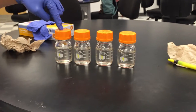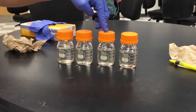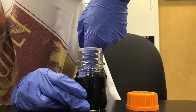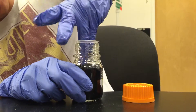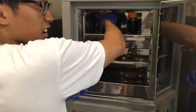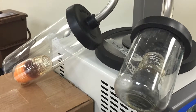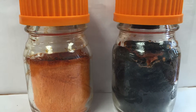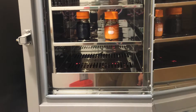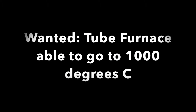We had 4 samples: Sample 1 was an ambient-dried carbon aerogel; Sample 2 was an ambient-dried carbon fiber-reinforced aerogel; Sample 3 was a freeze-dried carbon aerogel; and Sample 4 was a freeze-dried carbon fiber-reinforced aerogel. The PAN fibers were impregnated into the solution — ideally in vacuum to prevent air pockets, but we didn't have the equipment. All 4 samples were placed in the oven at 50°C for 1 day and 95°C for 2 days to promote cross-linking and gelation. Half the samples were freeze-dried, while the other half were solvent-exchanged with acetone and ambient-dried at 50°C for 3 days and 100°C for 1 day. At this point we had our RF aerogels, but were unable to secure a tube furnace with nitrogen controller to carbonize our samples.